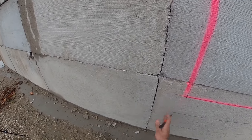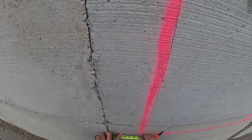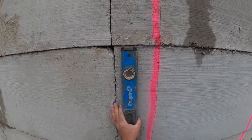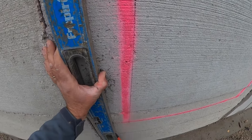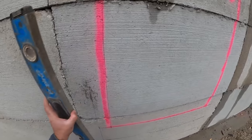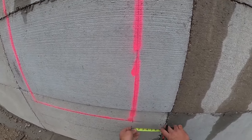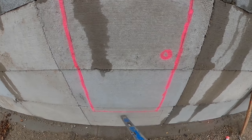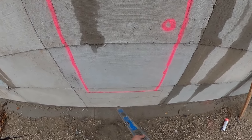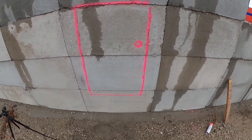I'll draw a vertical line and our forms will start at that vertical line as they come out. I'll measure three inches and plumb that up to get our marks, then do the same thing on the other side, and we'll be ready to start putting our forms up. That gives you a nice visual - this is your kick plate, this will be the beginning of the first step, and this will be the beginning of the second step. Now I'm going to grab some wood and show you how we actually form these up.